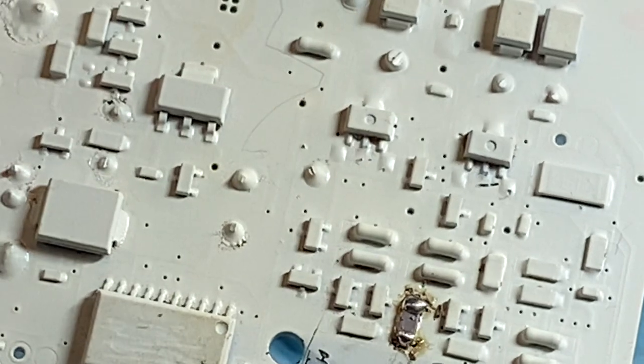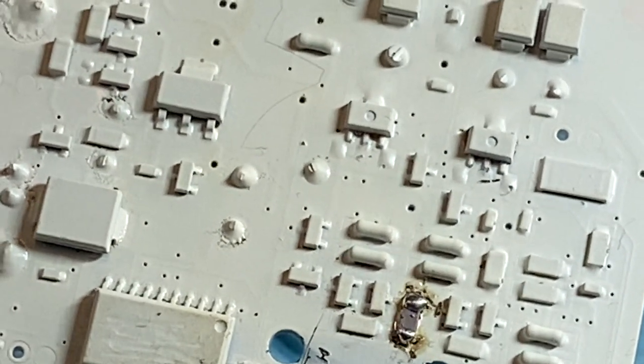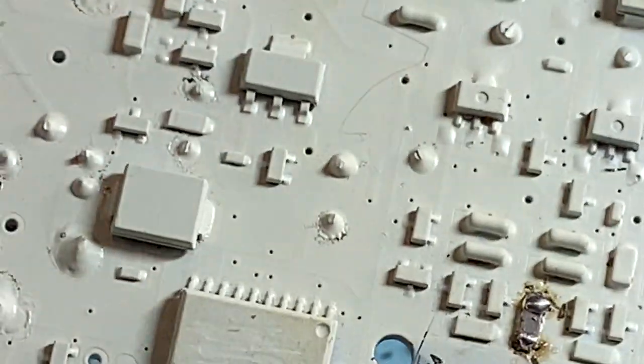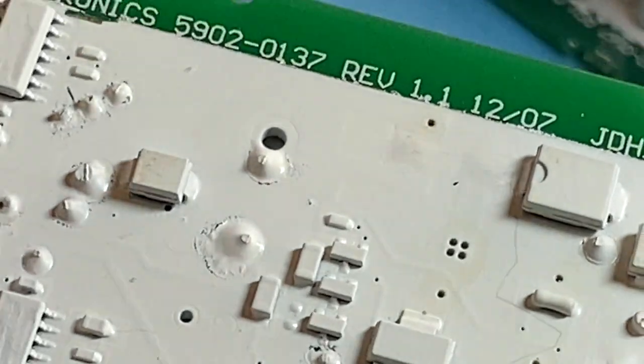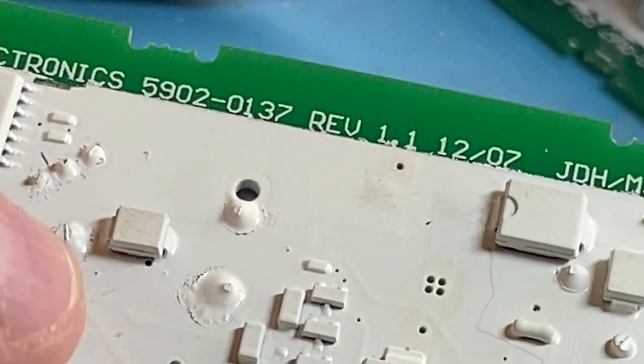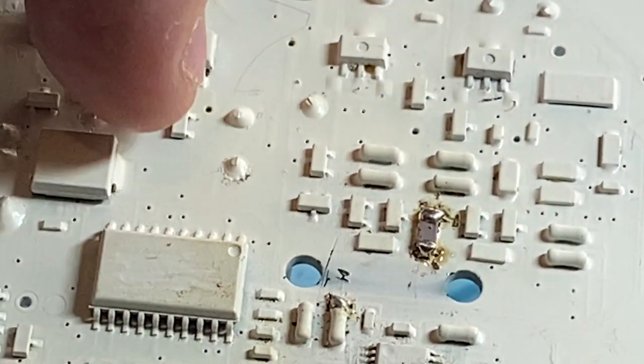So that's just another 200 volt rated, 3 amp N-channel MOSFET. Nothing special. You can always check your detector operation. See that diode there? That is your negative 15 volts on this side of it. The fat one there, negative 5 volts.